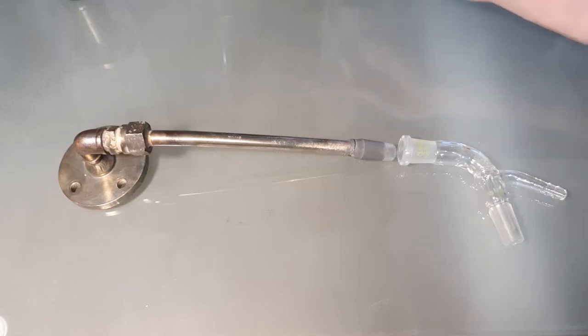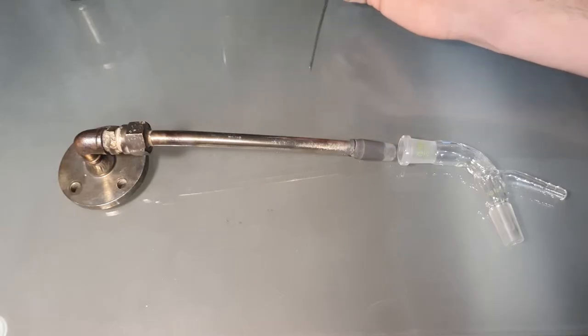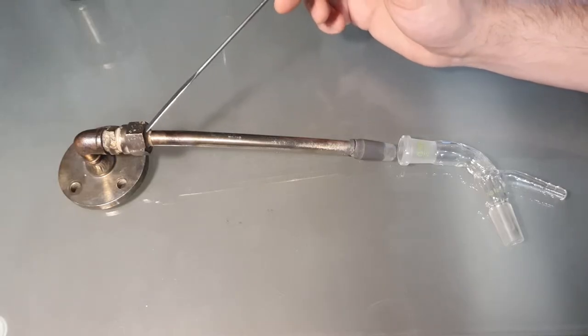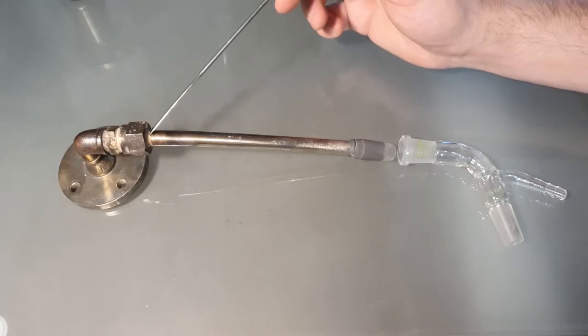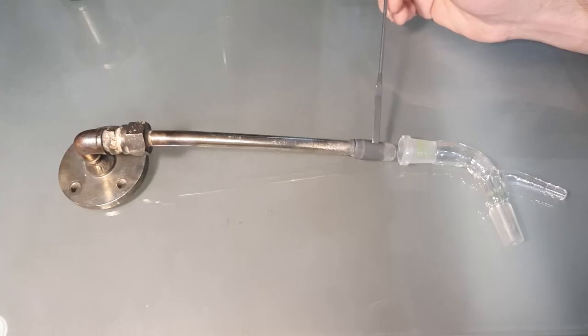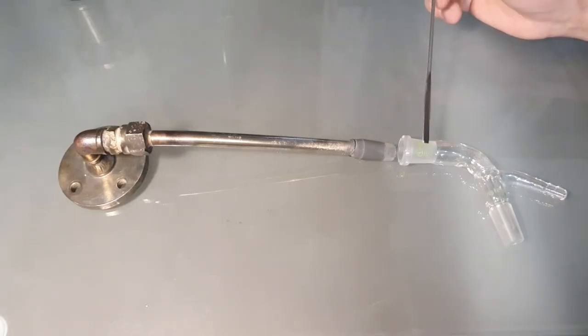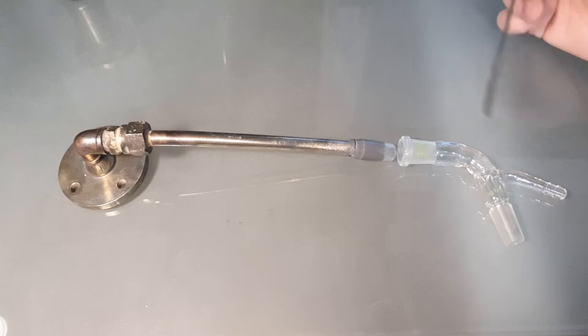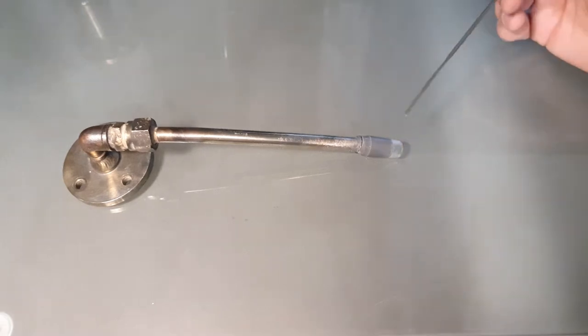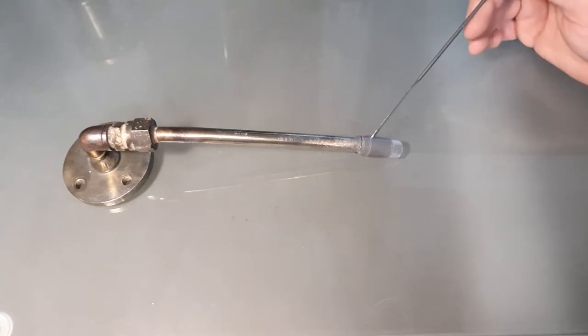On the upper part I am using a stainless steel cutting ring fitting to attach the stainless steel tube to the reaction vessel. I also braced this fitting because I noticed there was still air leaking into the system through it. I epoxied a glass ground joint to the end of this tube using JB Weld, and the vacuum seal is great, so I can connect a vacuum adapter for both the vacuum pump and the receiving flask.